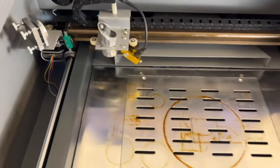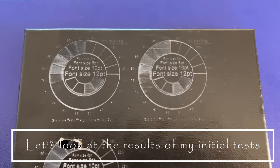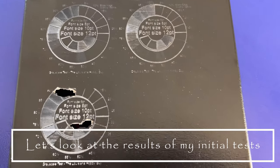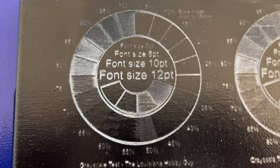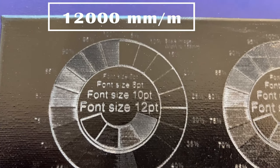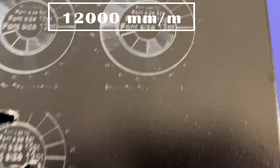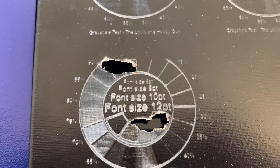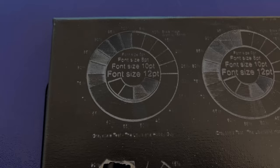So if you watched any of my other videos, you know I primarily do canvas engraving. I've been doing it on the xTool D1 10-watt laser and that works amazingly. I did a small canvas here to run a grayscale test. My first test was at around 12,000 millimeters per minute at 5% low and 100% high power. At 11,000 millimeters per minute it was fine, but once I got down to around 10,000 millimeters per minute you can see it burned right through. So pretty much for canvas engraving you want to stay at 10,000 millimeters per minute and above.